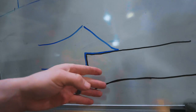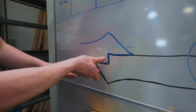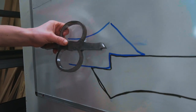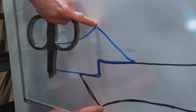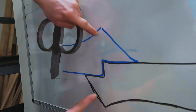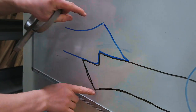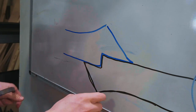We're gonna cut another piece of steel with a ball on the end, and it's gonna have this upset and forged down scarf, which is gonna interface with the scarf from our guard, and you see how they meet up here. When they do meet up, you end up with all this extra material. Now, the thing about forge welding is forge welding is better the more you hammer on it at welding temperature. It helps fuse those two separate pieces of steel together. So what you want is a lot of thick material so that you have plenty of hammer blows to strike before it's in its final bar form.